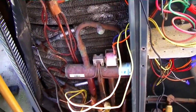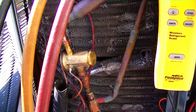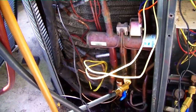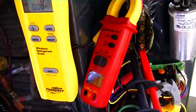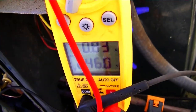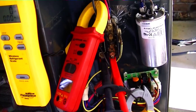We're going to switch it over to heat so we can check how it runs in heat mode as well. The unresolved part is we're going to have to complete the process at a spring check in a few weeks — the homeowner won't be home and I haven't had a chance to check the airflow, which I do every spring anyway. We'll get it pretty close and fine-tune it at spring maintenance. I have a couple meters set up: we have 6.6 amps on the compressor, which is well below rated load, 246 volts, and 0.83 amps on the fan, rated at 0.9.